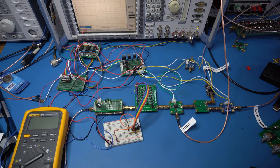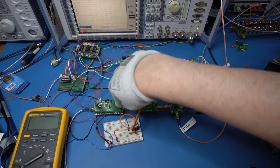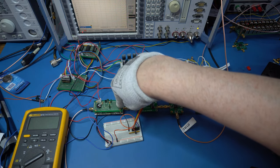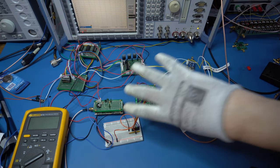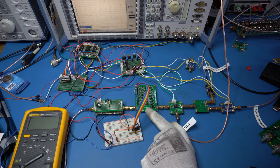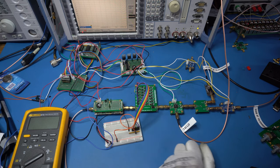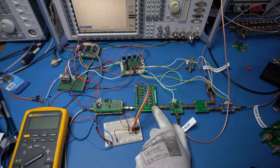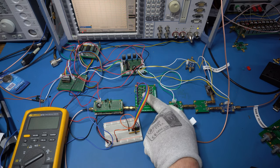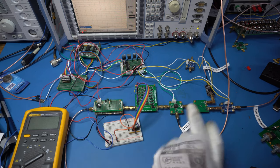Right, so the voltage-controlled attenuator, which is our AGC and gain control, is now controlling the levels going into the radio. We don't have an RF amp at the front end. We're now running into this Jani Labs multiband filter, which is obviously a bandpass filter. This is currently set to the 14 meg mark. There's a number of settings on there.